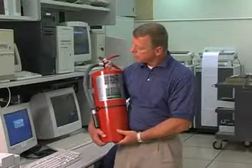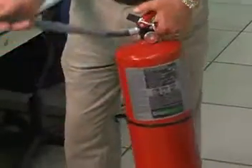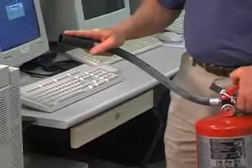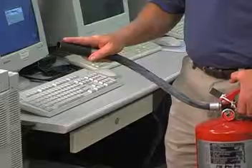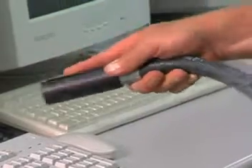Some of the other information on the nameplate are the instructions to use the extinguisher. To use the extinguisher, you would place the extinguisher in your left hand. You remove the ring pin and remove the hose from the hose retainer. You place your finger alongside the nozzle tip to help direct the agent onto the hazard. You depress the levers, aim the agent at the fire, and sweep side to side until the fire is out.